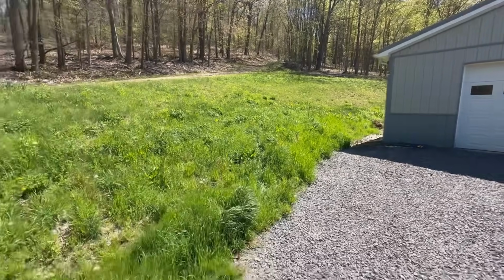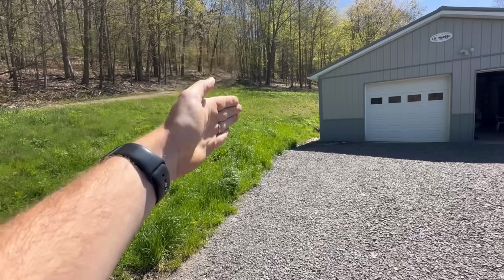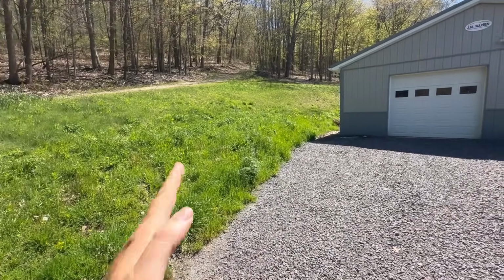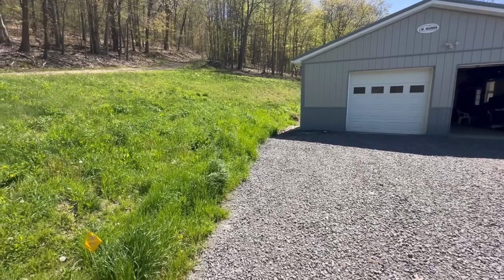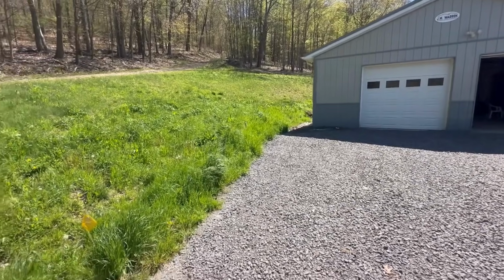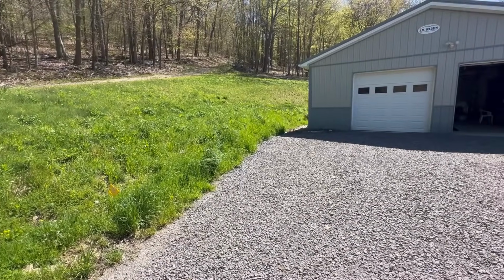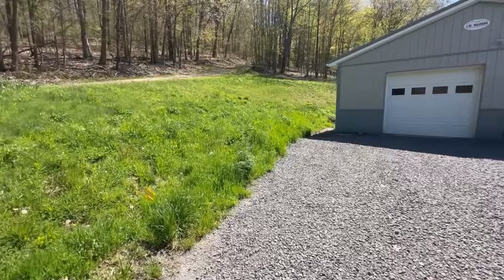But like I said, this project is going to generate quite a bit of fill. If I've got 4 or 5 foot down to establish fall out from the shop there, and I'm going to start tapering it in right about there and go the full length of the building back, it's going to create a good bit of fill, not nearly enough to level up the building, but it's going to kill 2 birds with 1 stone. It's going to get this project done and lessen the amount of fill that I have to bring in to level up the site down there.